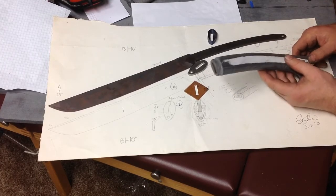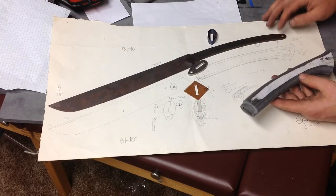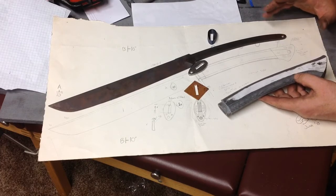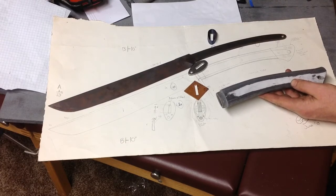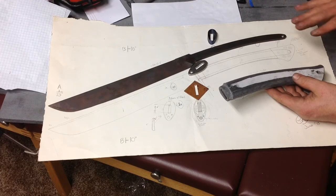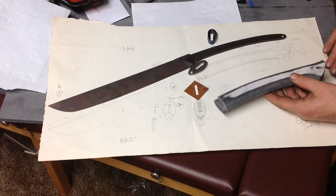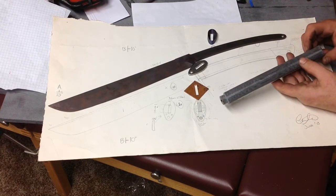I'm pretty confident this thing is going to work out really well for him. The blade is PD-1 and it's about Rockwell 60. I did a batch with the Mega Knives at Rockwell 62, and my competition chopper is Rockwell 62, but in some destructive testing I found that 62 was more brittle than I would like. It was still very durable — I was really impressed with edge stability — but when I did get it to chip, the chips were not the proper property I would like for larger blades. A mid-sized or smaller knife at Rockwell that high would be just fine; you're not going to get enough energy into it to make it chip catastrophically.